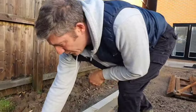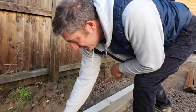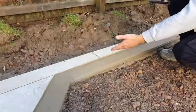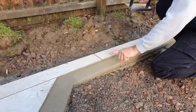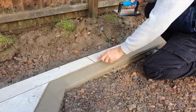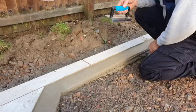But, you know, when we want the customer to come back, we want them to look at it and just think they look as if they know what they're doing. So what you've got to try and do is just keep the concrete down a little bit — about 10mm lower than the top of the picture frame. A lot of people will have it level, but when you cut the grass and it sits inside here, it sits up against this. Nice and neat. Get a 20, 25, 30mm pile. You won't feel that frame underfoot.